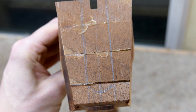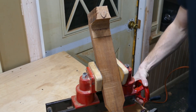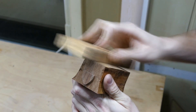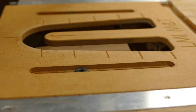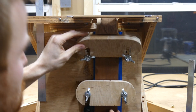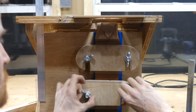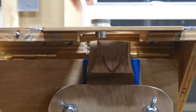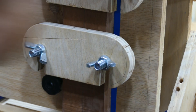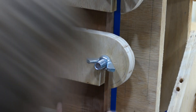I remove the excess material with a coping saw, then correct the angle of the sanding block. A lot of people struggle to get this angle right, but as Robert mentioned, it's not all that critical — so I wouldn't stress over it. I check my work and it looks good. I place the neck back in the jig. This time, rather than butting it up against the template, I lower the neck enough so that the guide bushing can be used. One last time I make sure the neck is lined up with the lines on the blue tape and tighten down the wing nuts.